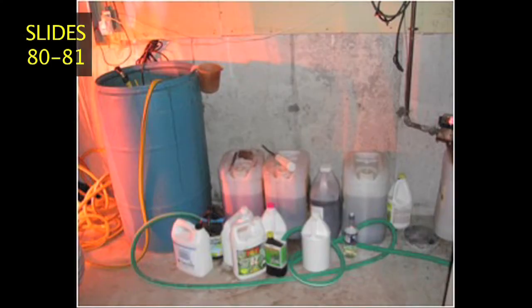Of course, we can do a hazard evaluation to help us with the selection of our protective clothing. We identify and evaluate the hazards that the protective clothing must protect the user against. Chemical hazards. Identify the chemical. What are the concentration levels of these chemicals? What are its physical properties, which we discussed earlier? And what are the quantities of it that we're dealing with?